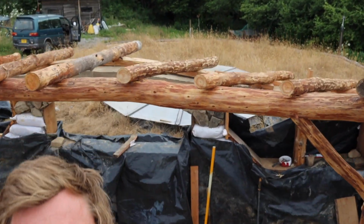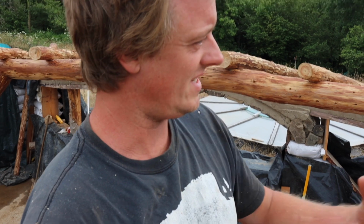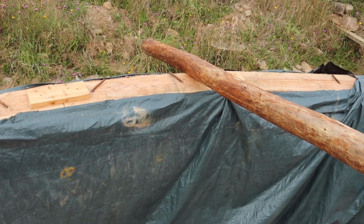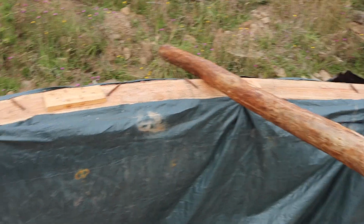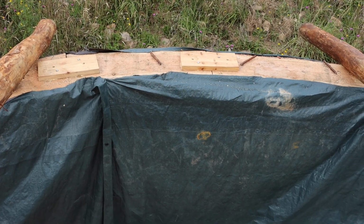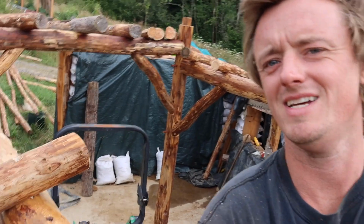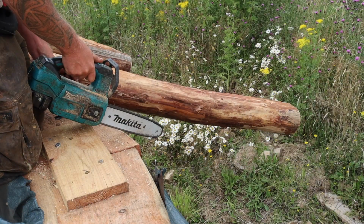I did that so that the front wall, being an inside curve, gets additional support from that wall plate and fixing right around them, so that it's fixed on both sides of a notch on the rafter. But these ones, the wall that we're fixing to is an outside curve, and because of that it's strong. So if the rafters are having a tendency of pulling that inwards because of the angle, it's actually just pulling it against the way that it's really strong. So that's good. I hope I sort of explained that somewhat coherently. It's been quite a long day, so excuse me if I didn't.